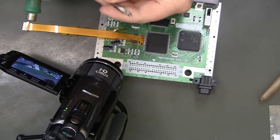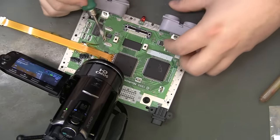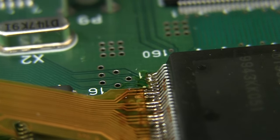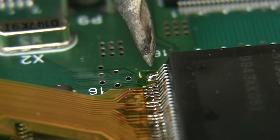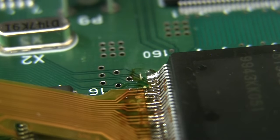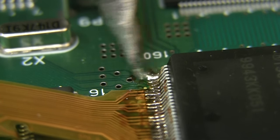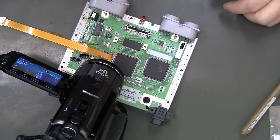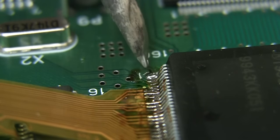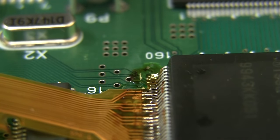Trying to find my halfway decent 939 here. And put some more flux on it. Hopefully it'll just wipe off. Not so much luck. It could be those two pins are both ground anyway. Problem is the 939 is not really great for solder removal. Well, they're definitely not both ground pin or power plane or whatever.